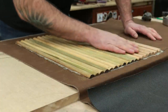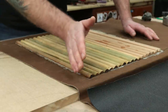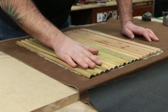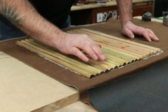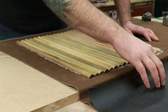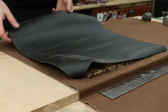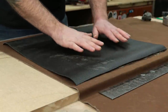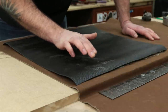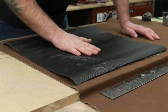These are all fairly evenly spaced and the measurement is the same from side to side - it seems fairly square. As this glue gets tacky, these really start to stick down and you can just nudge them a little bit, which makes it very easy. I'll get the weight on top of there - this is kind of like a rubber mat - because each one might not be the exact same height, so this mat will help to fill in any of those little gaps.